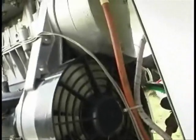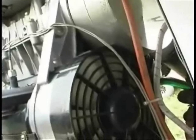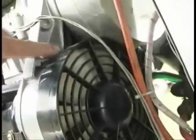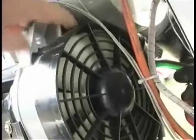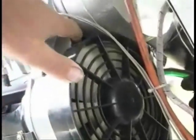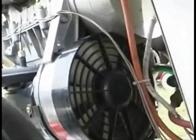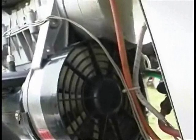One of the problems with some installations is that it's very difficult to check your fan belt or fan belt tension. What you can do is take your cover off and remove this tip here — it covers the belt. With the engine turned off, at any point in time you can come in and check your belt tension. That's on the 503, 377, and 447 Rotax engines.